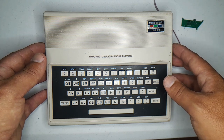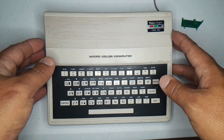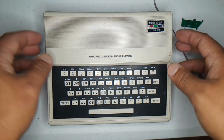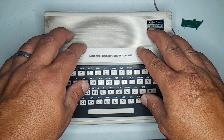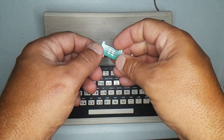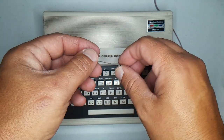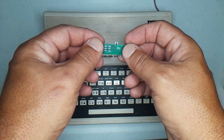I've done that by wiring straight into the VDG. I also have an adapter board — a VDG breakout board that I made — that fits well in the other Cocos because they have more girth than this one. However, the MC10 is thin enough where I can't close the case with that adapter inside. Coconut Bob has developed a very thin, low-profile breakout board that solders to the bottom of the main board. In this video, I'm going to install this and then hook it up to an RGB to HDMI.